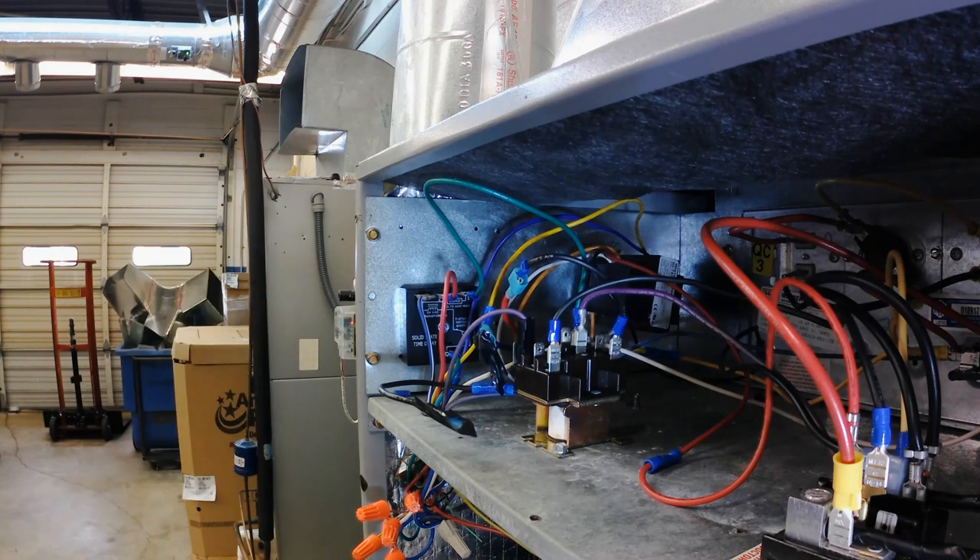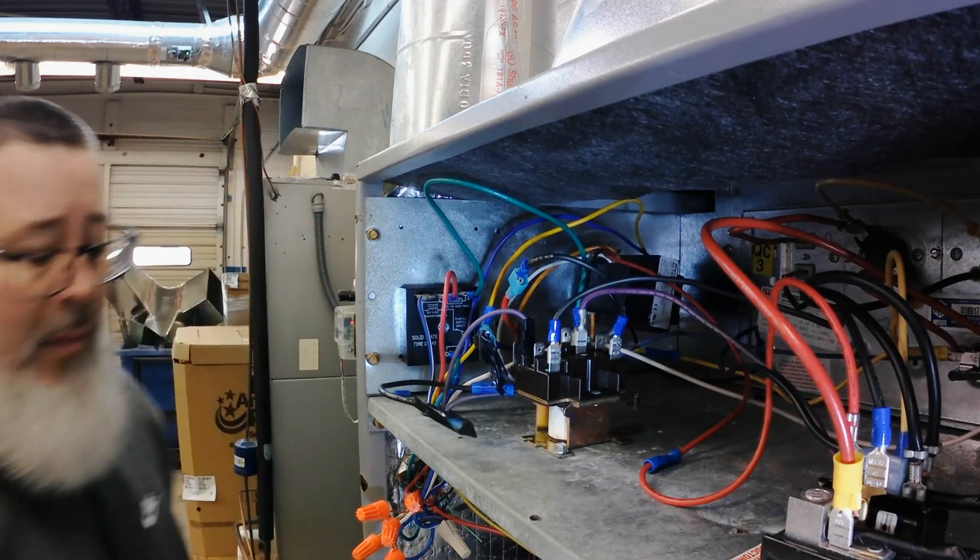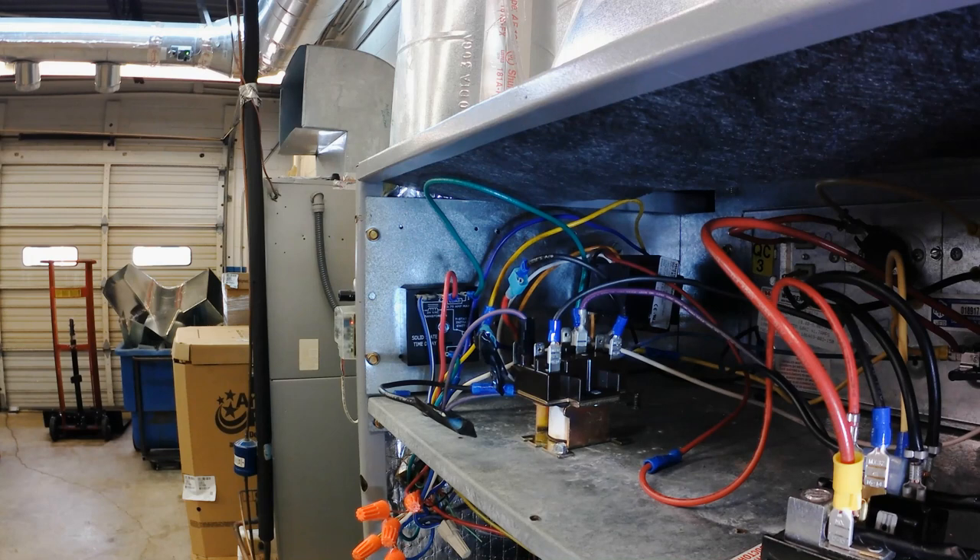This is on the zone board. Once the zone board reset, I turned the fan from auto to on - took about a second and it came on. When I turn it off, it's going to take about 45 seconds to shut down.